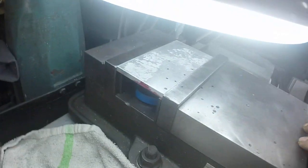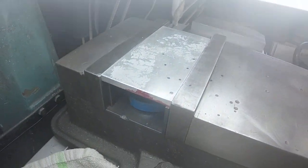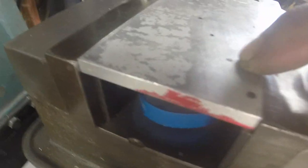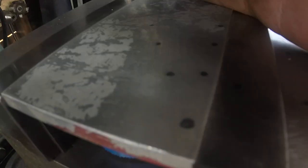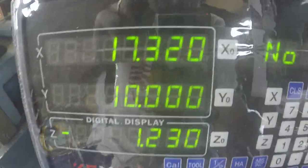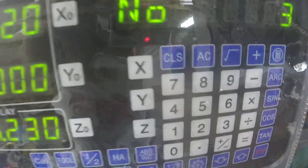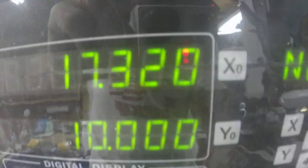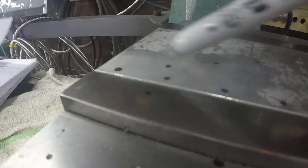You're going to mark that. That first hole ends up over here, off at a 30 degree angle. We hit the down arrow and we go again. Notice Y is stepping in 10 millimeters at a time, and X is stepping at 17.32 millimeters at a time. So we continue those holes out, making the four holes along this line: one, two, three, four.